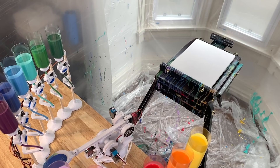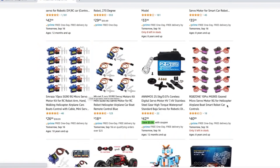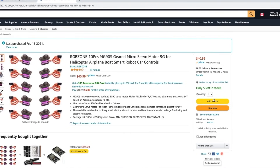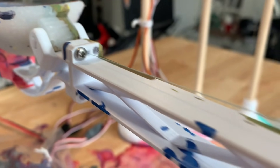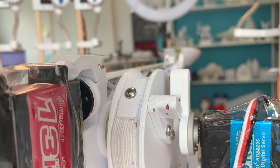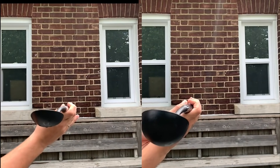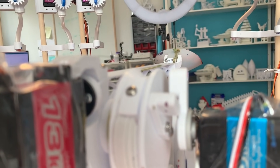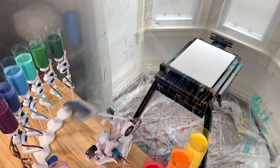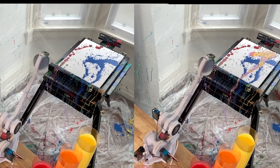Then there's the catapult arm, which not only needs to swing around and collect the paint, but also needs to wind up and throw it over and over. There's a whole bunch of powerful servos at work here: one to wind the elastic reel, one to move it around and collect the paint, one to release the latch, and one more that uses fishing line to tension the custom-made silicone cup that holds the paint. After testing out the paint-flinging properties of a few different spoon shapes, Jay decided to make his own adjustable spoon. He used a 3D-print to cast a design in silicone, which can change its shape by tensioning a bit of fishing line — all to add a bit of extra unpredictability to the paintings. It's a great project, and you can find more information, including the Arduino code, posted on the JBV Creative blog.